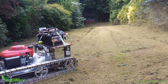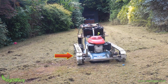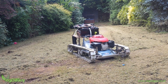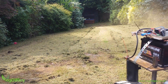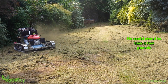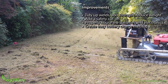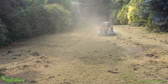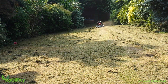However this was its first outing as a mower, and the blade height was not the only problem. If you look carefully here, you can see the forces involved have bent the 12mm bolt holding the front sprocket in place, and this is twisting the track slightly. I think I'll upgrade this to a 16mm bolt and cast a better support mechanism. I'll also tidy up my welds, add strength and try to deduct some weight if I can. I also want to add a safety cut off feature in case the mower ever goes driving off without me. I'll properly house the batteries and electronics, as well as set up an easy means to charge the batteries without unnecessary swapping of cables. But those things will take a little time to get around to, and the good news is my wife can cut the lawn again — I'm sure she'll be delighted about that.